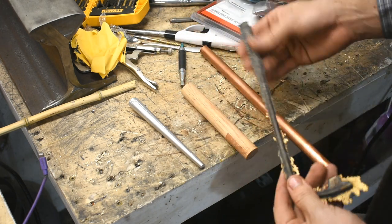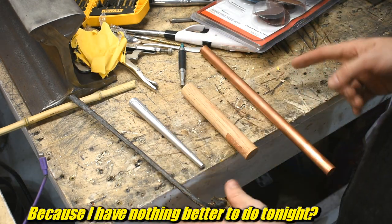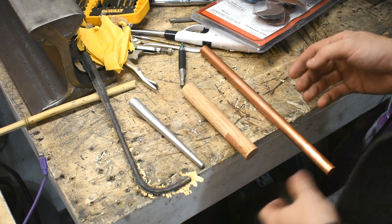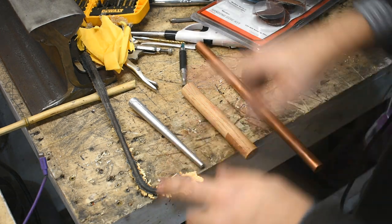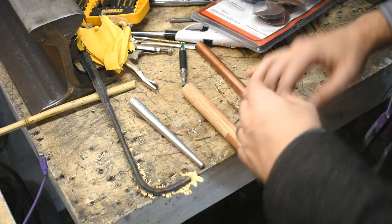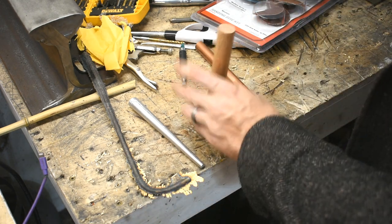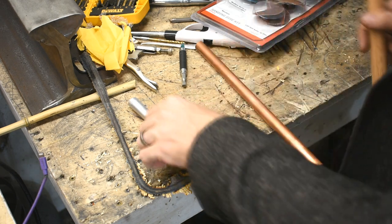And then I carved this a little bigger with a spoon. Why am I showing you this? Well, one main consideration which improves the surface finish is keeping track of the flow — the metal flowing through the mold. Unfortunately, I don't have good pictures of this. But I've been using this, which is bad. Very, very bad. This is better.